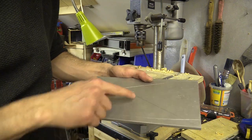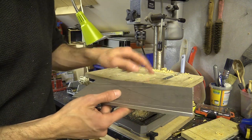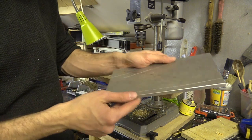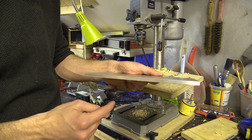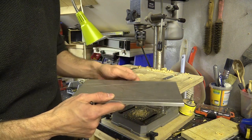The next thing I need to do is drill a 12mm hole in the centre of this piece of aluminium and a few holes around it which will allow me to clamp it to the top of the press. This is going to stop the stud connector I hammered in earlier from popping out, like a hernia. It would have been a lot more elegant if I had tapped a thread on this plate and recessed it between the ply, like the example from the beginning.